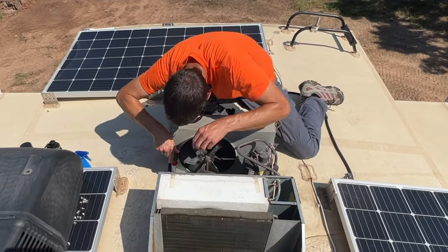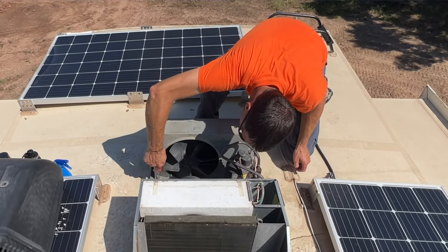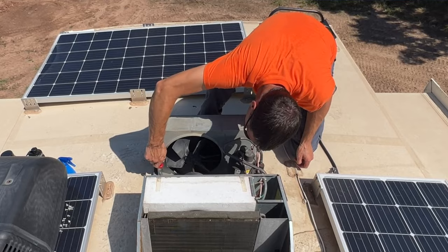This brings me to my first tip. You want to clean your air conditioner in the spring and the fall if you use it year-round. That way you're not cleaning when it's sweltering hot outside and it's ready to work when you want to use it. If you only camp seasonally and don't use the AC year-round, cleaning it once a year is fine — typically in the springtime before you want to use it in the summer season.